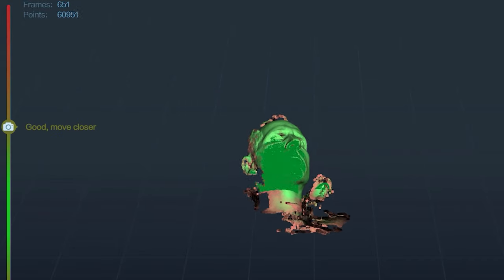These AirPods Pros are smaller than the recommended minimum 15cm. Creality recommends adding markers applied only to the table or turntable and using either Texture mode which supports markers, or Marker mode. After a few attempts I got passable results but I'm not sure I'd use the Ferret Pro for scanning small items. At the other end of the spectrum I tried scanning my VW Transporter van. Creality recommends adding markers and using Marker Mode to scan vehicles, as the scanner needs something to latch onto with the large featureless metallic areas. They recommend using 150 markers just to scan the front of a car and these markers appear to be fairly expensive and hard to come by. I tried scanning around the front of the car without any markers — it didn't do a bad job around the wheels, wheel arches, and front grille, but you would definitely need markers over the bonnet.